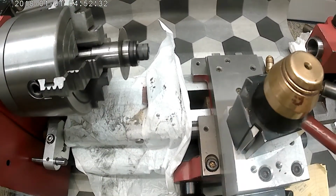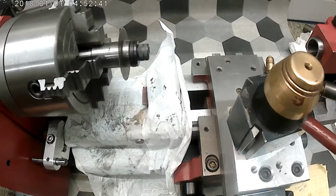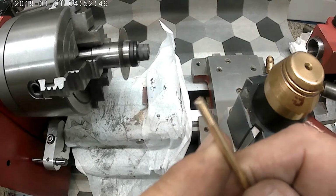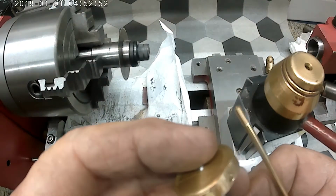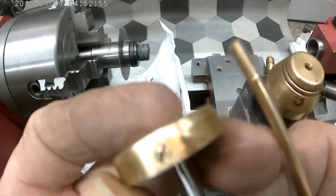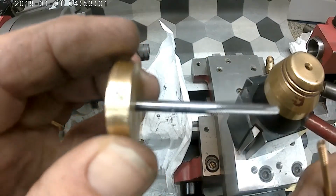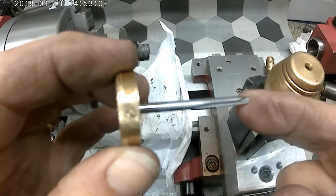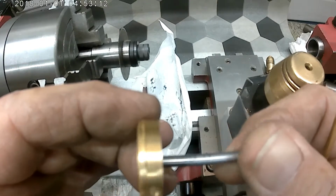I did not have a 6/32 screw, so I made one out of some brass stock that I had, and I cut a groove on the top for a screwdriver. With the exception of this being dressed up and knurled, it's a done project. It's for hand tapping very small taps.